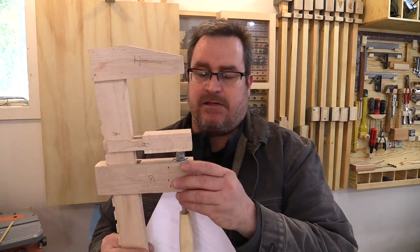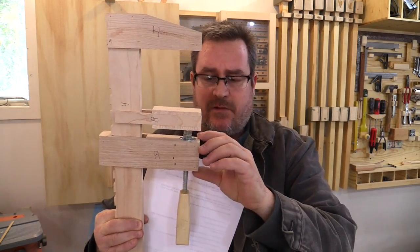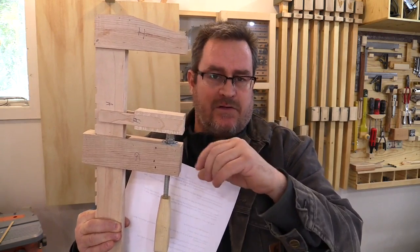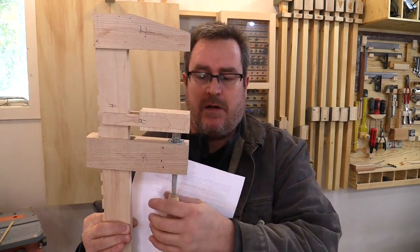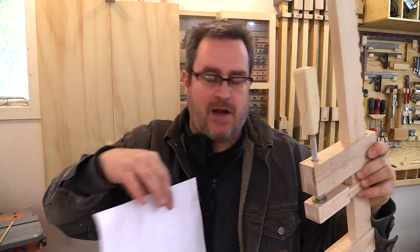There were also comments about my complete lack of safety using all my tools. The first comment here is about screwing the T-nut in. A guy said it isn't enough just to drive it in. If there's always constant pressure on it, yes, that would be enough — but otherwise you have to screw it in because it will pop right out. Those little tangs on there just fix it in place so it doesn't twist. That's what they mostly do. These things are made to be compressed into something and then bolted on from the other side, so the screws will hold it in — absolutely necessary in a project like this.